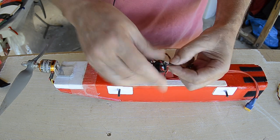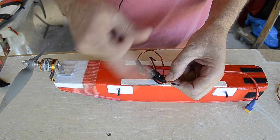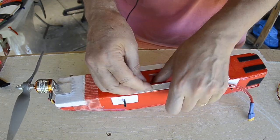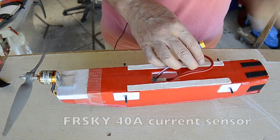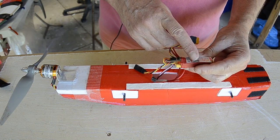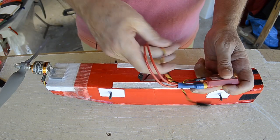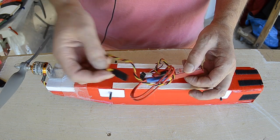The filtered power goes off to the camera and the video transmitter, and connects into the wing. I also have telemetry on my Taranis radio so I can monitor battery voltage and power consumption. This plugs in between the battery and the power lead, and this wire goes back to the X8R receiver in the wing which sends the telemetry back to my radio.